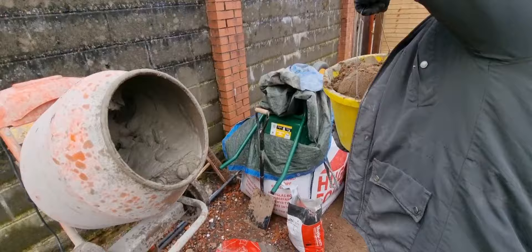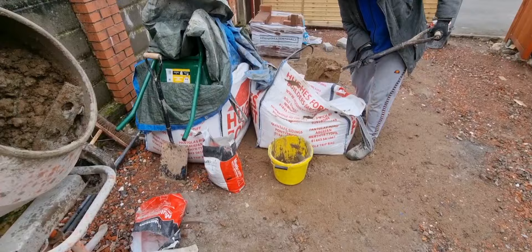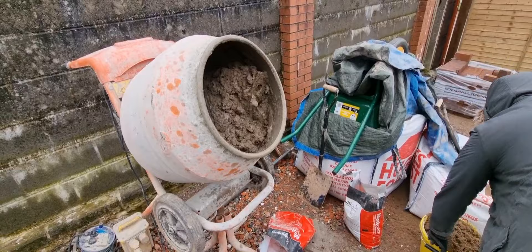So that's three buckets of sand. Please wear goggles — we're idiots. We have started doing it but we're not happy today because of the wind, and there's no excuse but we're not wearing it. Don't put your hand or your shovel in the mixer when it's turning because you could obviously injure yourself. Is that four now Brad? That's four.